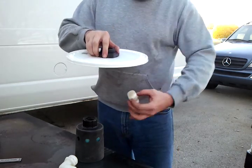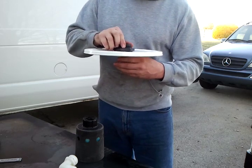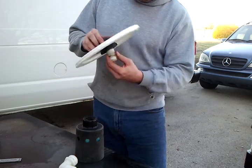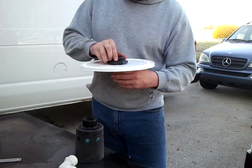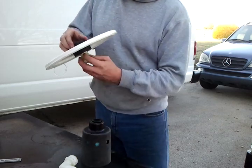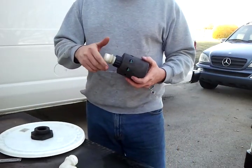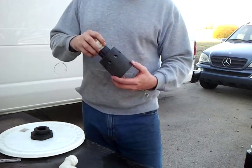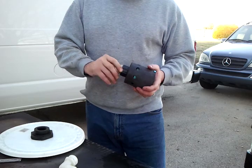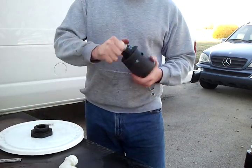I'm going to take a one-inch adapter — it's just male on both ends — and reach my hand into the tank. Generally I'll put some thread tape on there; there's already some on this one since I'm using parts I have sitting around. You're going to screw that in, then bring your float valve in and put it on. Or you can put the nipple onto the float valve first and then take it up in — same either way. I like getting it good and tight on the valve first, then when I go underneath I can get a lot more grip.